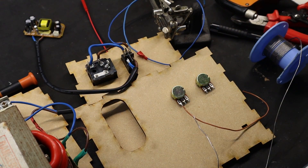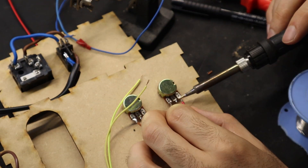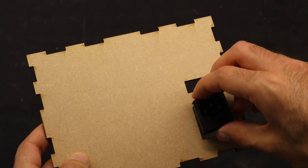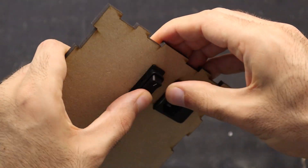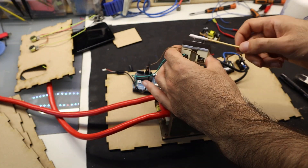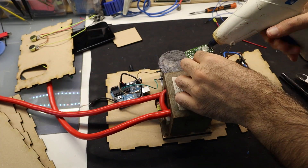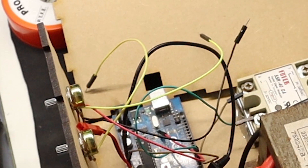The build itself is fairly easy. The front panel contains two potentiometers that allow you to change welding options — you can easily wire them without checking polarity as it's easy to reverse it from firmware. On the back I placed a fused plug with a switch that delivers power to the whole machine. The Arduino is powered by an old phone transformer. The SSR and the transformer are held down by screws so you can easily remove them, while the other components are just hot glued to the wood. There's also a hole for the USB of the Arduino so you can easily upgrade the firmware.